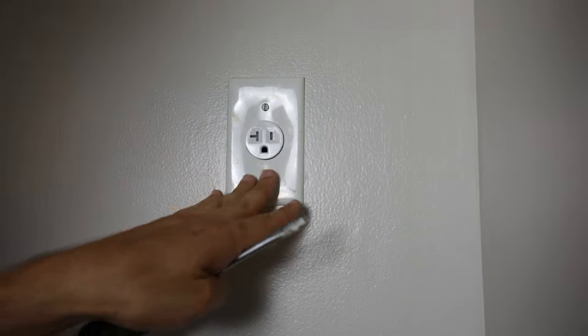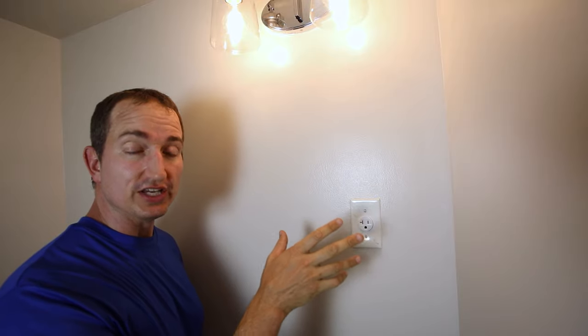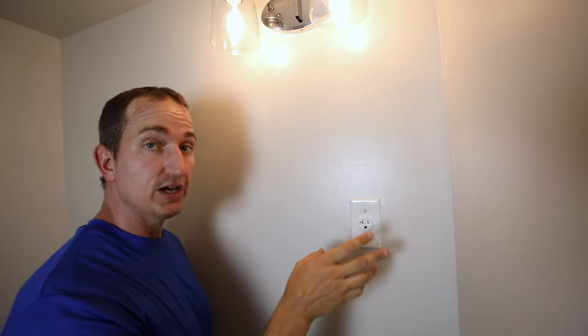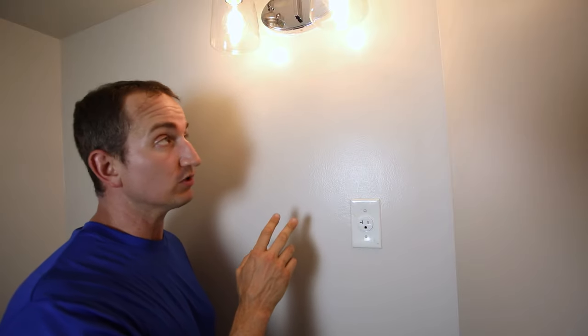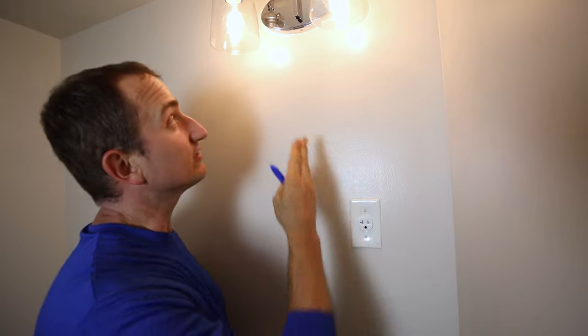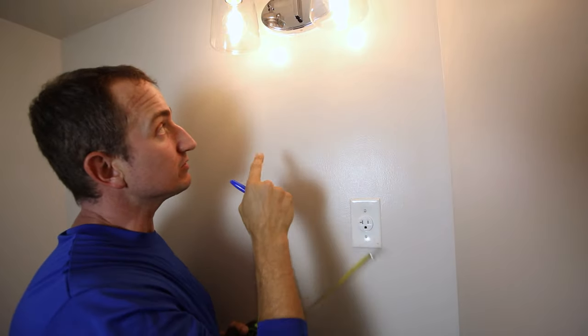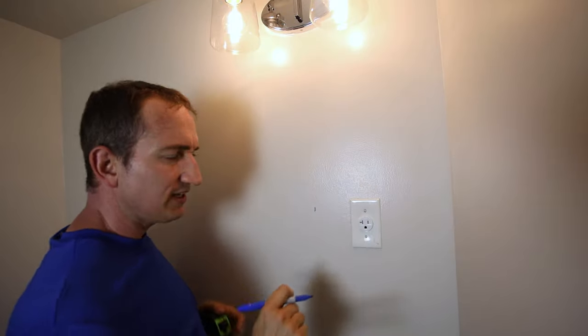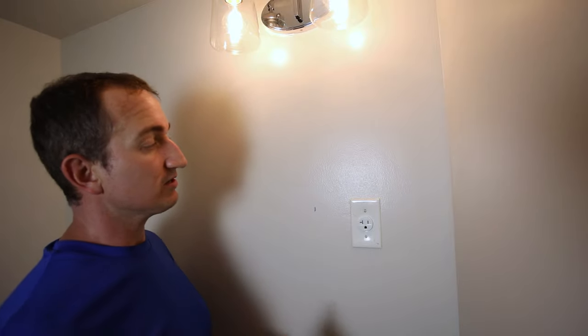Now I'm going to mark for the positioning of the mirror. I planned all this before building behind the wall, so I know roughly where it goes. Normally I'd use painter's tape to mark measurements and then peel it off without leaving marks, but today I'll mark directly on the wall and keep the marks behind where the mirror will cover. First I'll mark the center of the mirror — for a 25-inch vanity, that's 12 and a half inches. The light up above is already centered at 12 and a half, which is lucky. I'll use that screw as a reference and also measure from the wall.